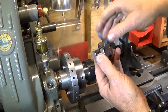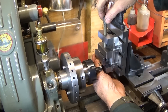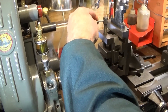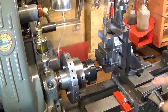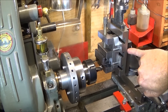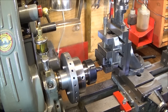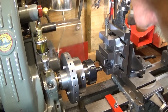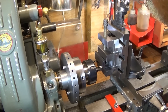I've taken all the screws off the tool holder and put it in the vice so it's clear, then lock it up. I've set the slide at the correct height, and when doing milling across ways I lock the screws to lock the gib strip on the slide. Then I zero the tool on the tool holder.